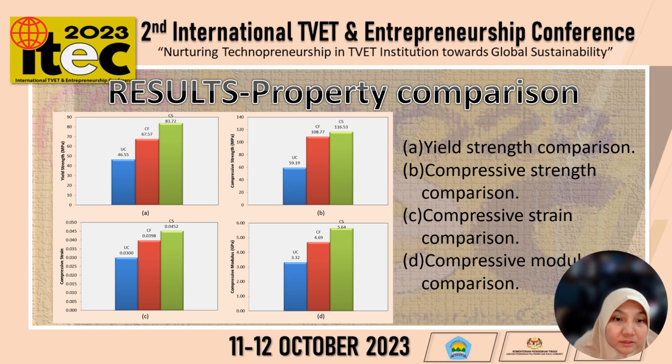Figure C shows compressive strain comparison. UC sample 0.03, CF sample 0.0398, and CS sample 0.0452. And lastly, figure D shows compressive modulus comparison. UC sample 3.32 GPa, CF sample 4.69 GPa, and CS sample 5.64 GPa.